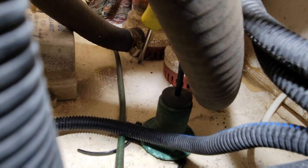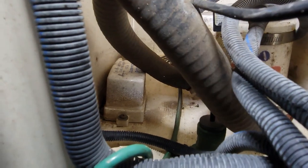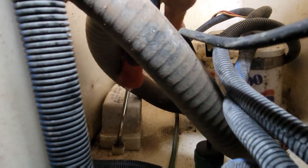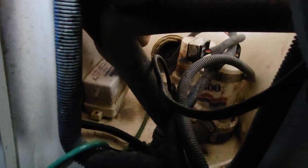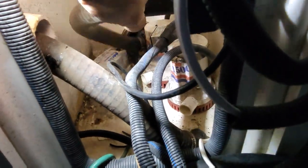Let's see if we can get this hose undone — it's difficult to reach the other one too. Let's get our auto float off; we're not going to be reusing that. We'll attach the new one to the pump. Since we're already back here, there's no reason to reuse the old stuff — we'll update everything to the modern field sensing switch style, the water witch. There's the float. Sometimes if you twist the tube you can get it off. There we go — that's one. The other one came off easy too. Now we should be able to pull this stuff right out.